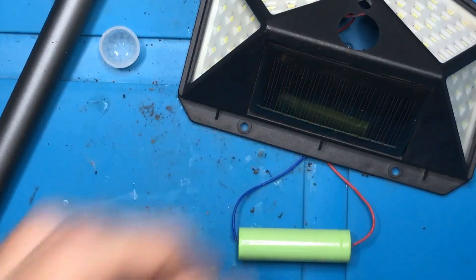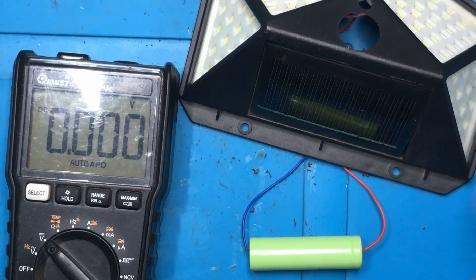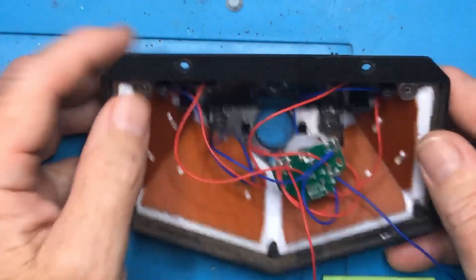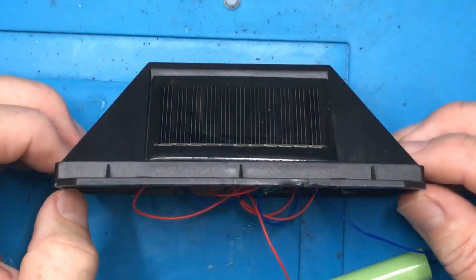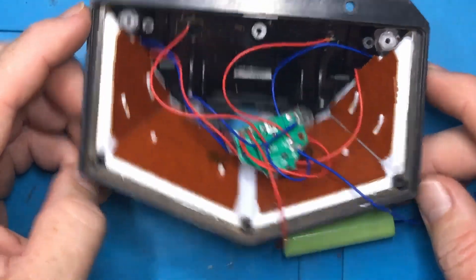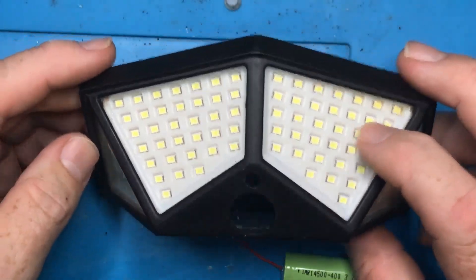Let's see if there's any life left in this battery. Yes — it's pretty low at 2.7 volts; it should be 3.7 volts rated. So the battery hasn't actually failed. I've always looked at these things and thought, wouldn't these make great housings for electronic outdoor electronics projects? With the inbuilt battery and solar charging, even the light could be used as an indicator, and I'm actually reasonably impressed with this.